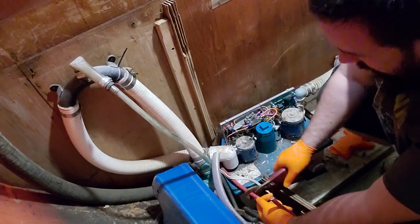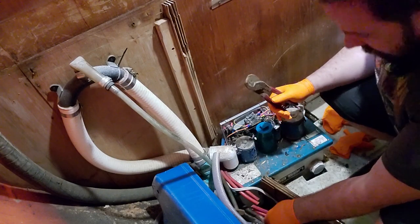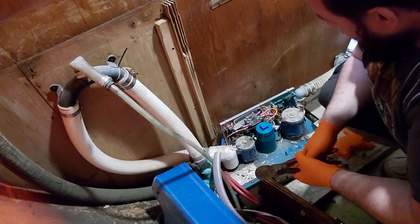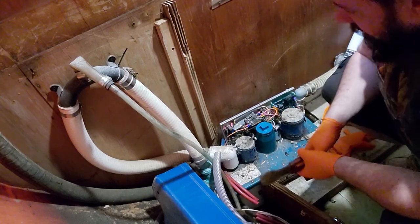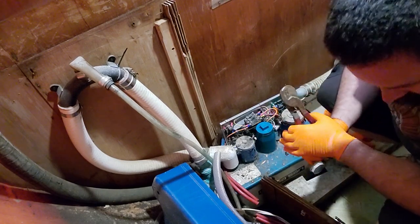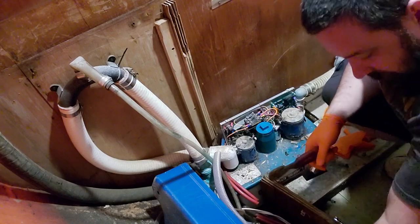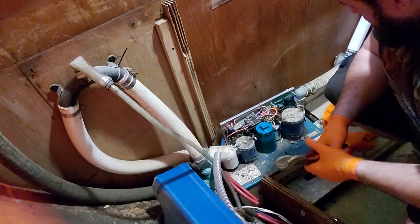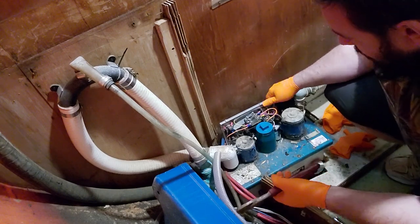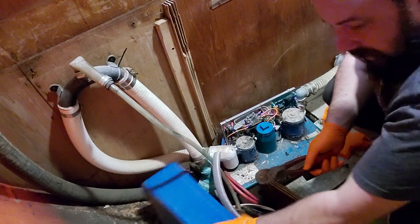I'll start stripping this stuff out of here. And I'm going to have to go drag this 110-volt line out of here. That is hot, and that's the one that goes to the outlet over here. So I'm going to go find that in a few, get it disconnected. And then, looks like the bonding system's still hooked up in here, at least. That's good. And it's not even bolted down. Look at that. I just got to cutter on out of there and she'll come free. So let's get that done.